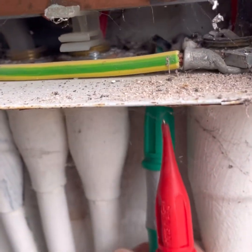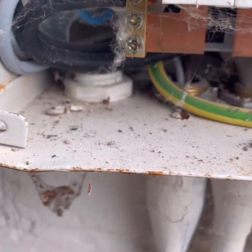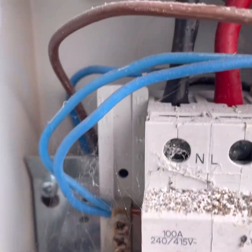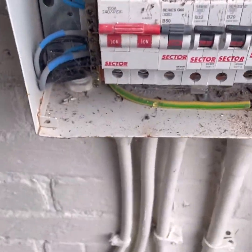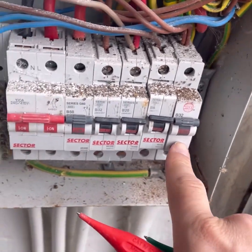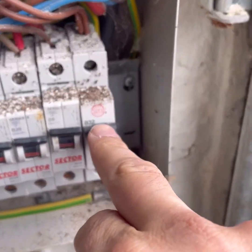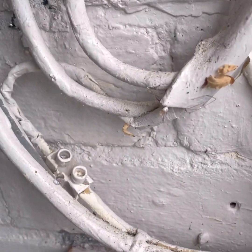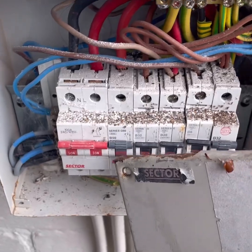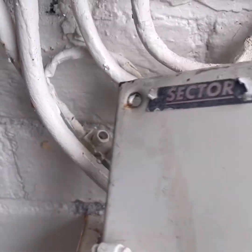There is a lot going on in this board - lots of IP issues top, front, and bottom. You've got mixed breakers that I don't believe are made by the same manufacturer. There's a lack of RCD protection, and I know this circuit does sockets. There's twin-and-earth up here which I think feeds a sub-board - it's the tails going up to a board in the top of the annex on the first floor. The basic insulation has just been painted over, going up on 16mm twin-and-earth to another board which I've yet to find.